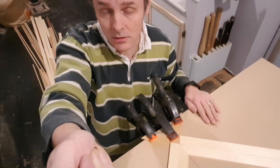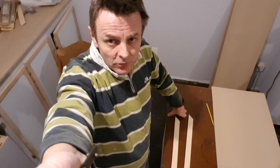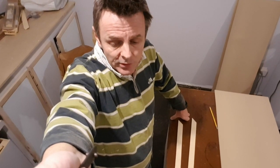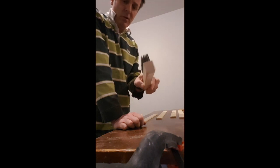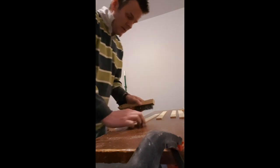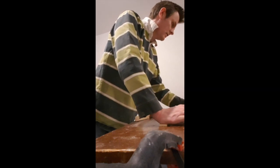The first thing I'm going to do is give it that weathered look on the pine, and I'm going to do that with a wire brush. I'm ready to begin weathering the pine — it's going to be a couple-step treatment. Number one, I'm going to wire brush it. Then I'm going to treat it with a solution I made with steel wool and vinegar, and with some strong tea just to give it a good color. I'm going to start with a regular wire brush — an iron brush you can buy at any hardware store — and just brush it. That strip looks good, so it'll go in there and I'll continue as I move on.